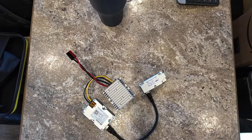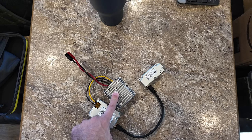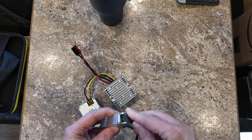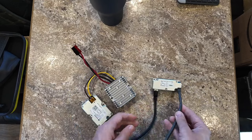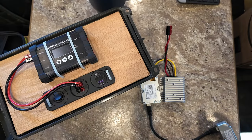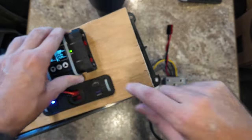Now that we have all of that stuff made up, we have the mini HDMI cable converter to RJ45, the RJ45 connector run into the power over ethernet injector, and the power supply to get 12 volts DC from our battery to 48 volts DC that the Starlink wants. This is the HomeFi router — there will be more information coming up on this in a future video. The power supply gets plugged into the battery box, and we are pulling power out of the system.